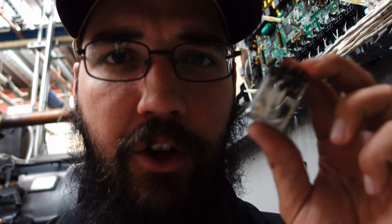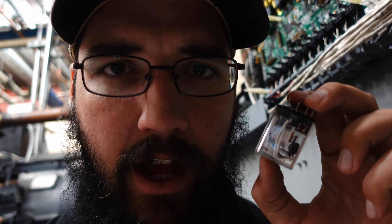The compressor never cycled, and our little LED never turned off or fluttered — nothing. We ended up having a spare relay laying around in the panel, so I swapped them out to see what happened. The symptoms completely stopped. So that was my main question — was it the relay or was it the base? At the moment I'm thinking it was the relay, because we were losing continuity between Terminal 3, shutting our drive down, which was leading to a head pressure trip.